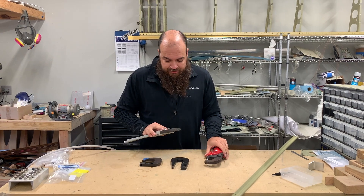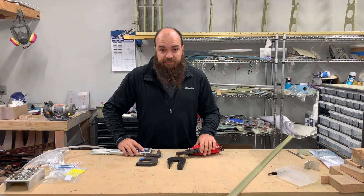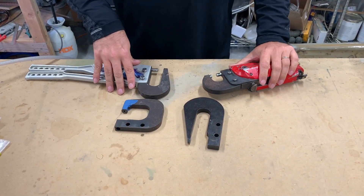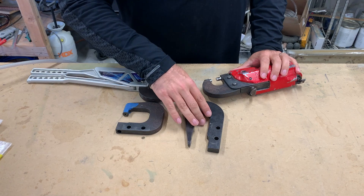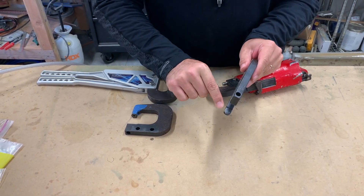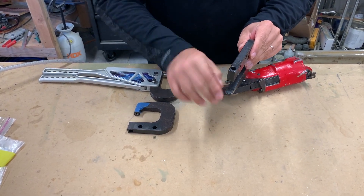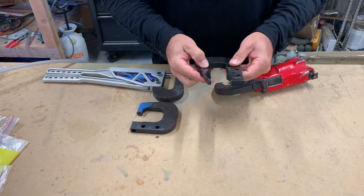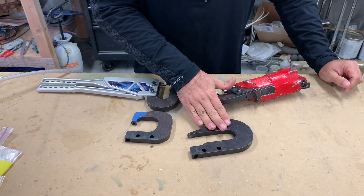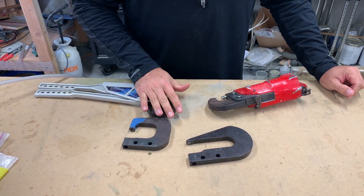When it comes to the different size yokes, I have four yokes here. The first is a slim nose four-inch yoke — you'll see there's no spot for a rivet or a die up here, it's just flat. This tends to flex quite a bit, so I try not to use it. There's not a lot of metal here and it will flex and be a little finicky with rivets, so this is a last-resort yoke for me.